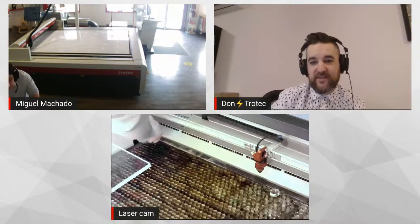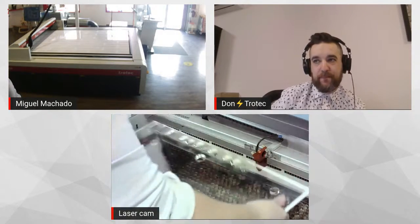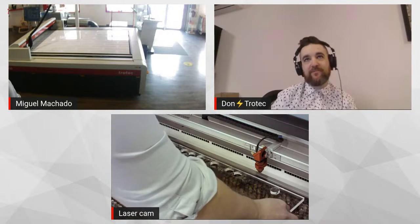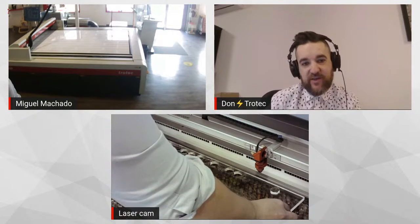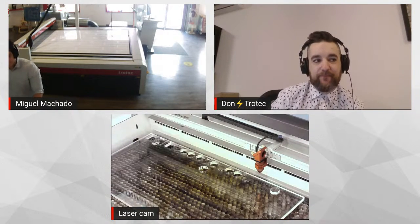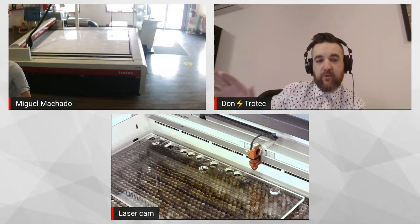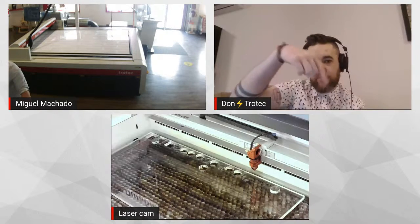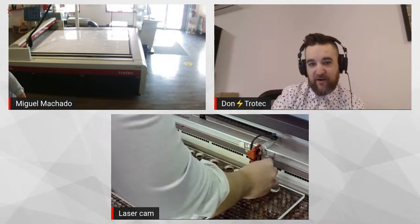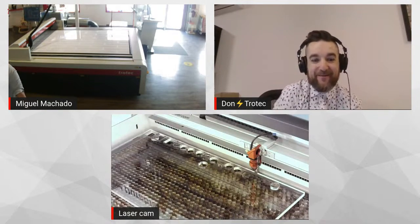One thing I would say too is that if you're trying to replicate the technique that Laser Dave showed in there, you can also do sort of a vacuum. I think in the video he covers his entire laser bed with tape and only cuts open the area where the paper towel is going to be. So the suction underneath it is as powerful as he can possibly get it, which also helps to hold the paper towel in place. Yes, so it's not blowing around.